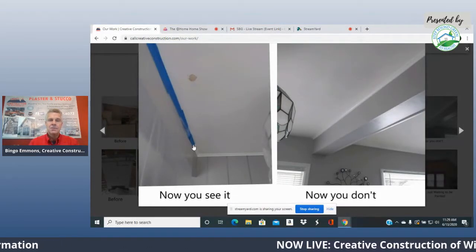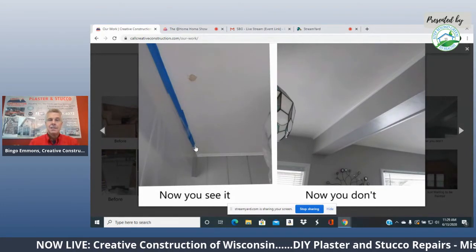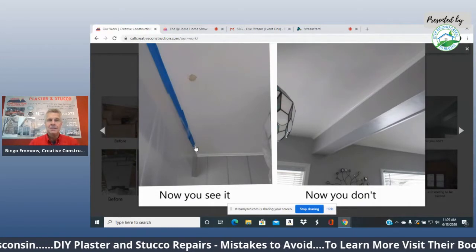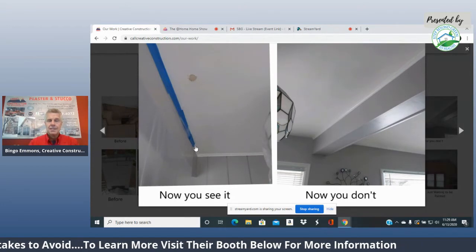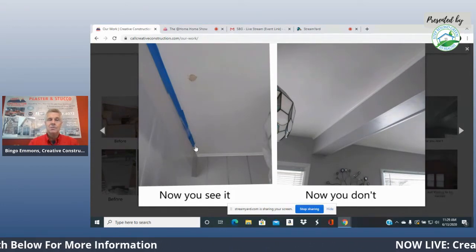So when you chop them out, it's considered a lead containment, a hazardous area. If you are doing these on your own, you need to cover up the dust that falls down where you are doing your own plaster. A lot of times it contains lead, especially in any house built before 1978. You have to assume that it contains lead.